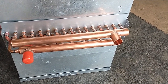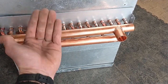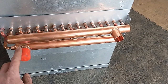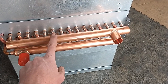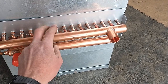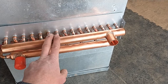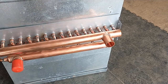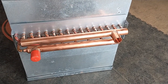About which outlet is supply and which is return: if your airflow is moving in one direction, pump water into the outlet on the exit side of the airflow and out the other. You want the air to exit at the hottest tubes. If you pump in on the same side the air exits, the air leaves on the cooler return tubes. Counter-flowing the water opposite to your air direction gives you maximum air temperature — it's not a huge deal, but every little bit helps.